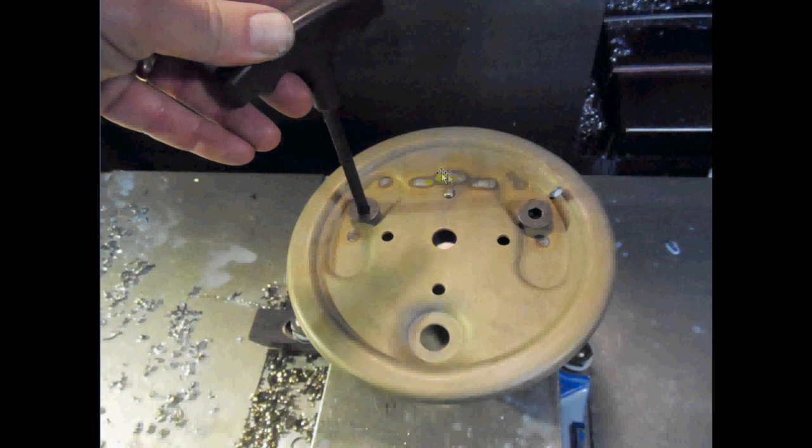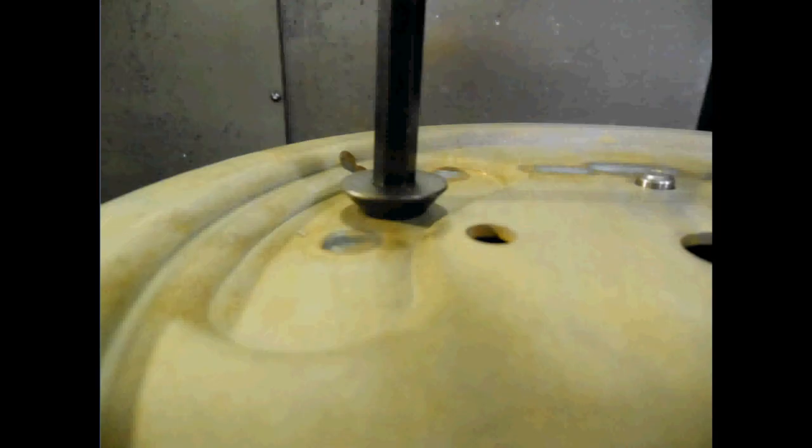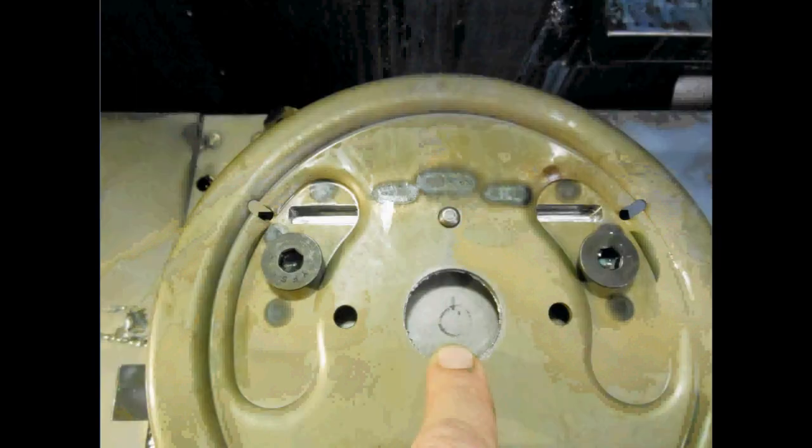So now I know the part is timed correctly as far as it's square. These 4 holes, you can see that they're all lined up. So it has centered my part and located my part just using the flatheads. And this is kind of what it looks like up close. You can see the head wedges into the hole lightly. You can see I'm not putting a wrench or a pipe on this Allen wrench. It doesn't have to be held that tight. You can see how thin the part is. And then when you're all done, there you go.